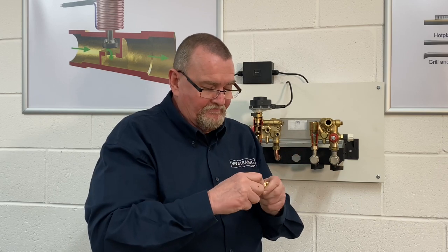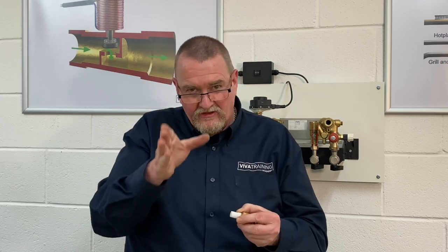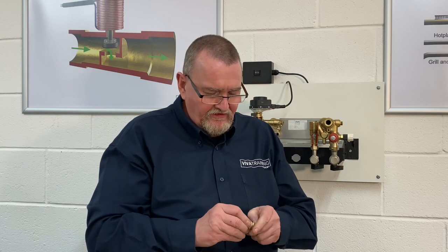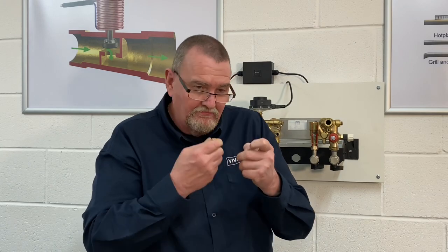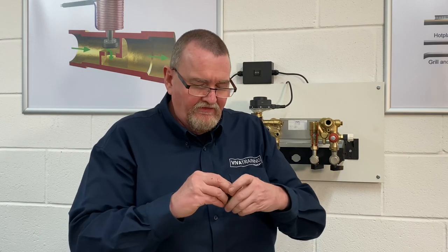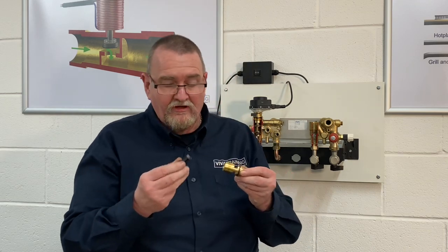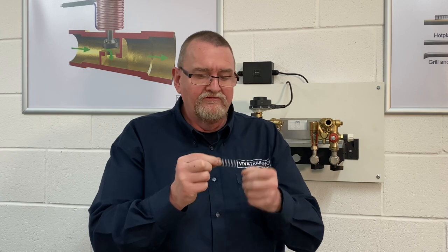The turbine type is on the Eco Blue and the new 600/800 range. When you take it apart, underneath there's a flow restrictor — a simple little plastic flow restrictor with a rubber O-ring. As water pushes against the inner piece of plastic it pushes the O-ring outward, reducing flow. Underneath that is the bobbin — the little magnet that moves up and down — plus a spring. One thing that can happen is a faint metallic tinkling sound when the customer runs a hot tap, which is usually the spring becoming compressed.